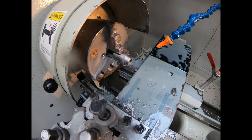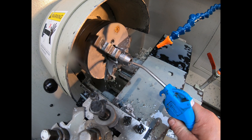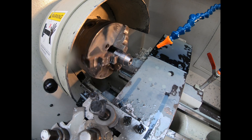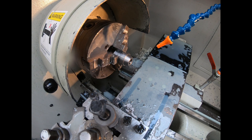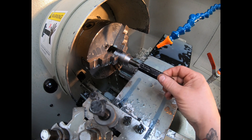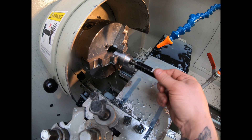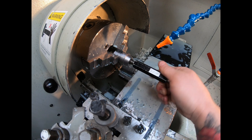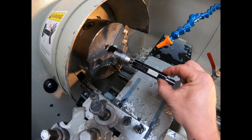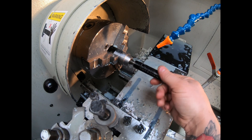Let's pull it off, clean them out. And I know this is already going to fit, and as long as you've got good alignment with your tailstock, you'll end up with a nice fit with an absolute minimal amount of play. Probably can't even see that, but that's a good thread.